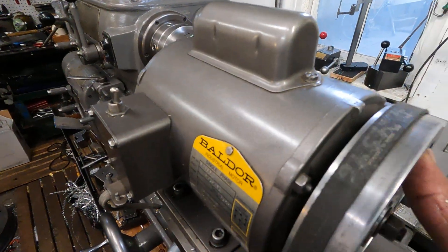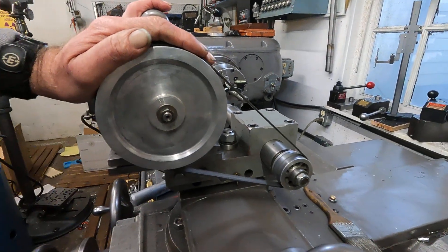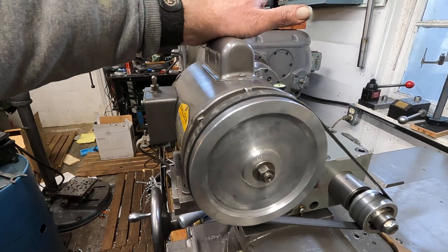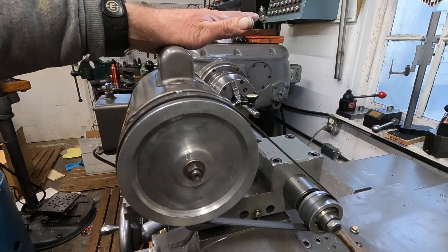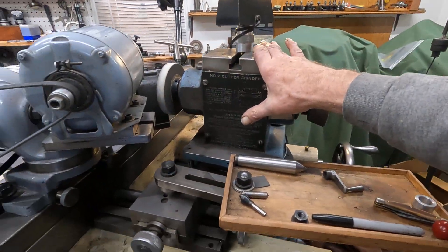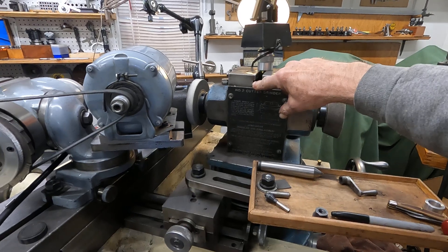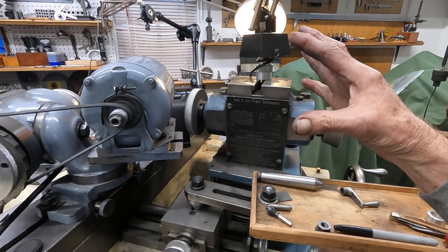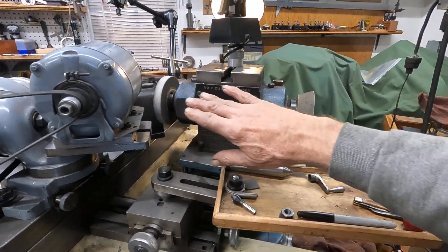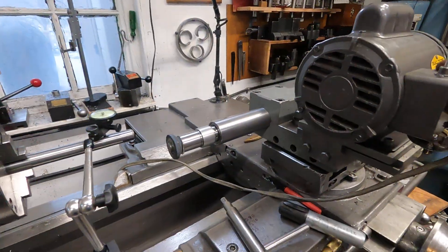I usually put a date on things — this one says 1995, so they do last quite a while. I fabricated this spindle; it's got precision bearings in it. I'm going to be making more spindles because there's a lot of things I do with the tool post grinder. The Cincinnati No. 2 cutter grinder has slots and mounts, and I can mount a tool post grinder on there with a tilting head and extended spindles — anything I want. One of the problems with these old cutter grinders is extending a stone out, but I solved it with this.